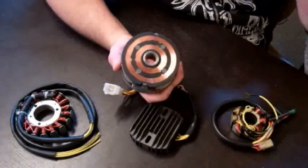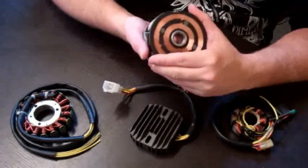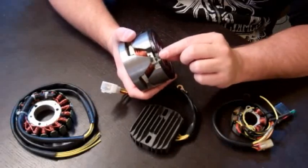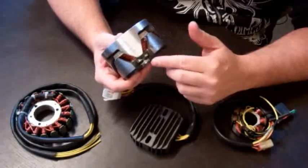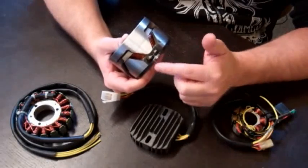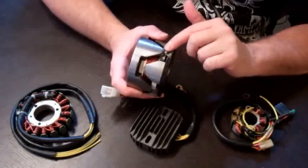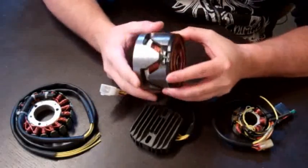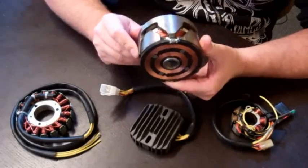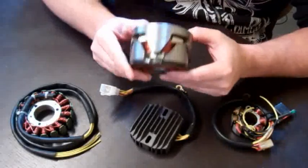As well as an extremely good connection between the brush and the rotor. The connections between the field coil and the slip rings — here and here — are a heavy duty soldered connection, and then we epoxy over them with high temperature long life epoxy that really secures this connection. So these are some of the main features of our rotor for the CB motorcycles. They're extremely high quality, they really work well, and they are made to last a long time.